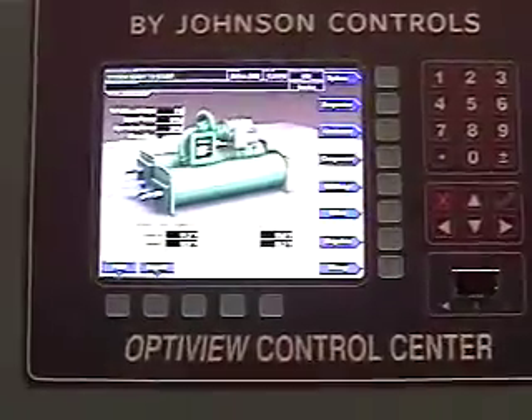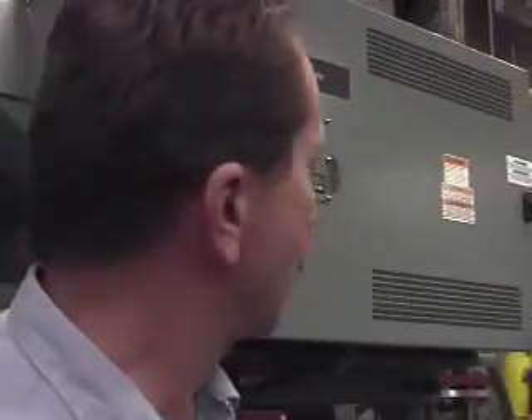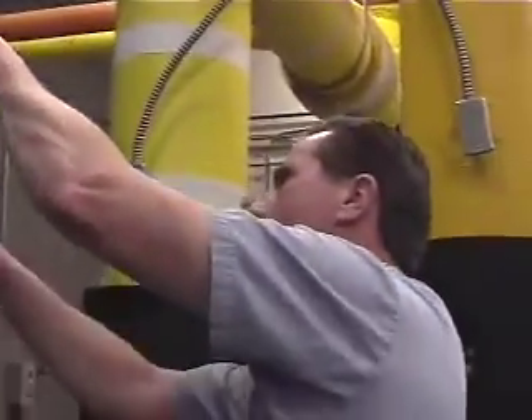When the machine starts up, this one being a solid state or soft start, you don't have the inrush you get with a cross-the-line starter, and you get less inrush than a Y-delta starter configuration. As the machine commands the chiller to come on, this trigger board will fire all three phases of power, and from stop to full RPMs on the motor generally occurs in about three and a half to five seconds. The machine rolls up very quickly without the inrush of a contactor start or Y-delta start.